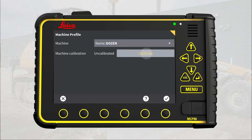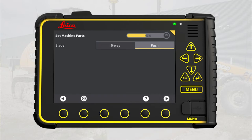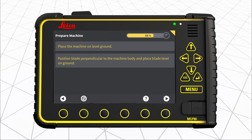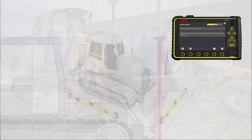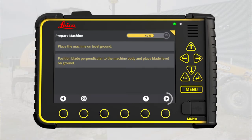Press Calibrate. In Calibration method, only manual calibration method is supported in the current release. Go to next page. Select six-way or a push blade according to the actual machine. This time we select six-way. Go to next page. Now remember that you should place the machine on a flat level surface. Rotate the blade to be perpendicular to the machine heading and leveled with the belts. Also make sure the masts are in a vertical position. When that is done, go to next page.